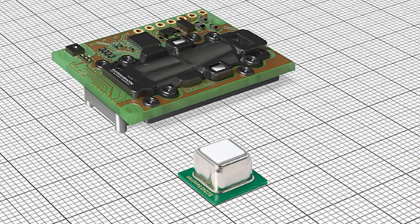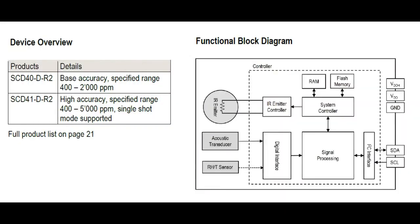What's really cool is this diagram showing the size difference of the SCD-40 versus the earlier SCD-30. It's seven times smaller — compacted on every dimension — and it's surface-mount pick-and-placeable, which is wonderful.